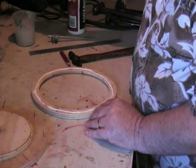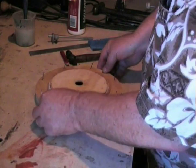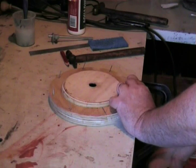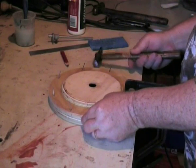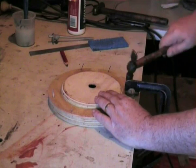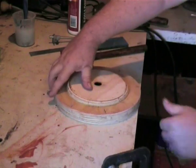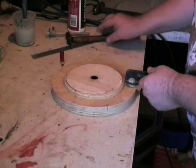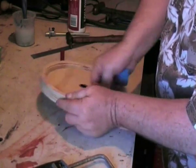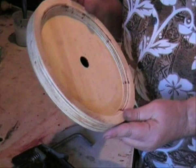For the outer piece, apply woodworking glue and brush it all over evenly. With our wheel plate, place it on ensuring that the outer edges align and match. When you get the right location, clamp it on this side ensuring it's correct, then just tap it into place — use the old mark one feeling gauge, your fingers. Reverse it, wipe off any excess glue that has oozed out, and there we have what is in actual fact our bowl shape, which forms the core of our road wheel.